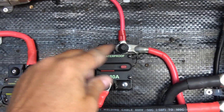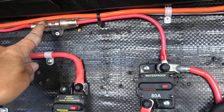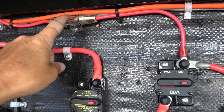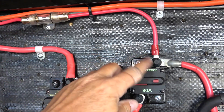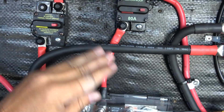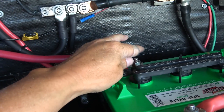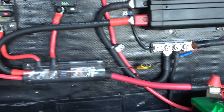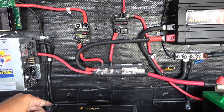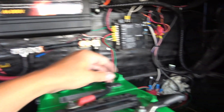I also have another one coming off that — that's for the mod where I installed a port for my ViAir air compressor, with a 30-amp fuse up here. So this breaker protects this wire, if something shorts here it pops this breaker, if something shorts in this wire section it pops this fuse, and if something shorts in this wire it pops this fuse. It's redundancy all along — you want to put breakers and fuses on every wire.